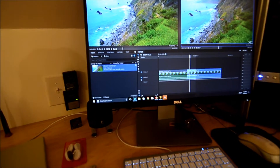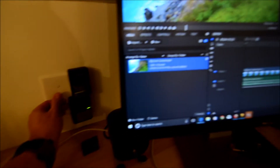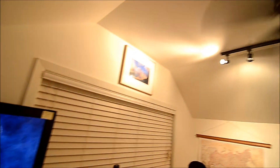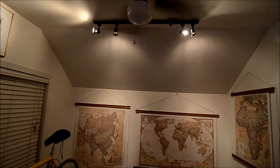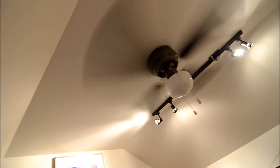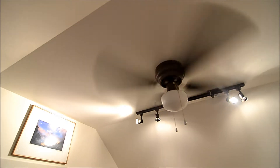What I had to do is add lighting in here, so I put in a nice easy switch to turn my track lights on and off. It was not easy to get the wire up — I had to run it all the way across the ceiling to the track lighting. I couldn't get the fish tape through, so I ended up putting the fish tape inside a pipe and it worked like a charm. It took me a day and a half to figure that out but I got it.